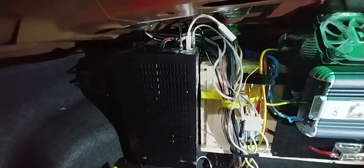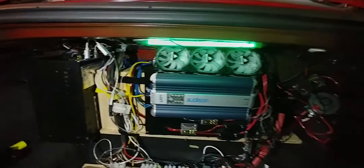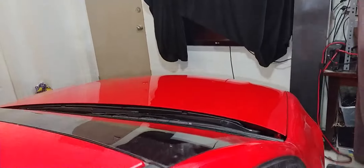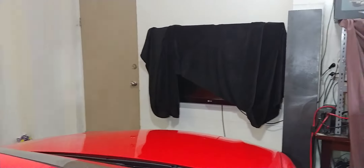It's got a DC to DC power supply, which I've had to recap at one time — it just didn't work, so I recapped it myself. It has the wi-fi antennas here. The wi-fi joins the hotspot at home so I can tune it from another PC. I have an old PC in the shed connected to a 50-inch TV on the shed wall, and I can tune it from the driver's seat using a Windows remote session.